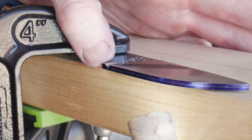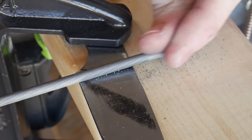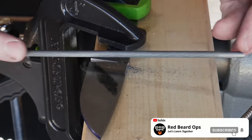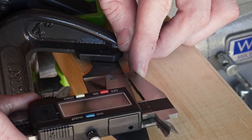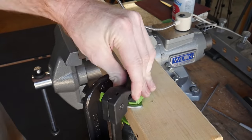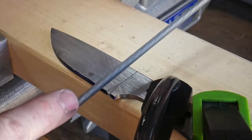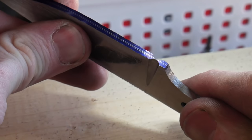This method is very effective in getting your plunge lines symmetrical when hand filing bevels. We're using a 3/16-inch chainsaw file to file in the plunge lines on both sides of the knife, and then we will not touch these plunge lines with the straight files once we start filing the rest of the bevels. I found it makes the blending process easier if you don't go all the way up to where you want your bevels — maybe a sixteenth to an eighth of an inch shy is your target. Even if you have a cheap belt grinder, this filing technique is a good option to establish your plunge lines and then use the belt sander along the flats to remove the bulk of the material.